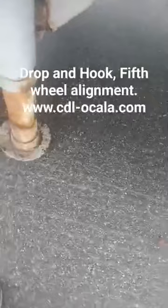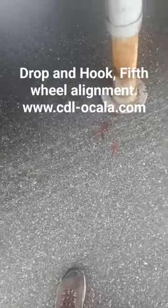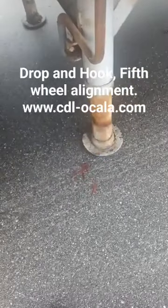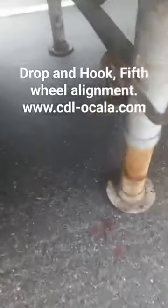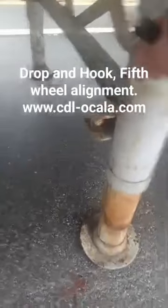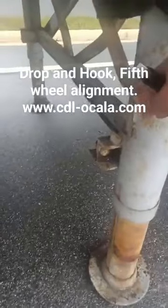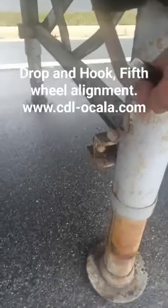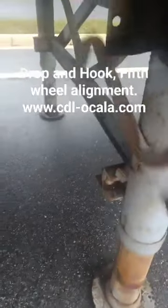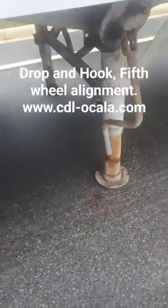Now, if I forget to leave it, let's say I'm in a hurry and I put it back in the crank position, that still might work because the trailer is only about an inch off the ground. When I drop the trailer and this crank handle gets jammed up there, before I get underneath the trailer with my air, I'm going to raise my suspension. It's going to pick the trailer up, the feet are going to come off the ground, and this is going to come right down. Why? Because there's no more tension. It's not being pinched in place.